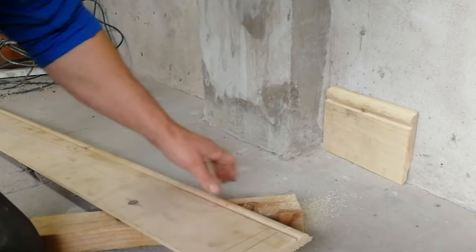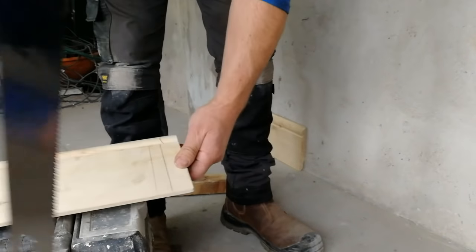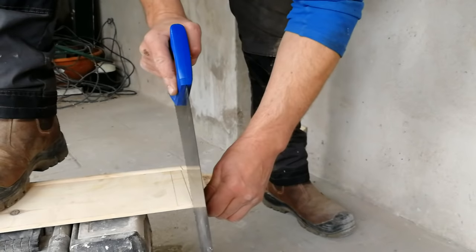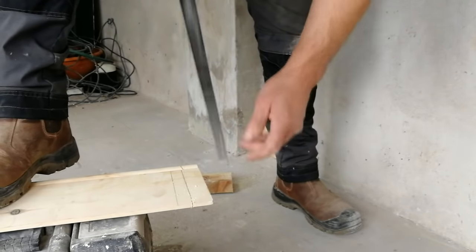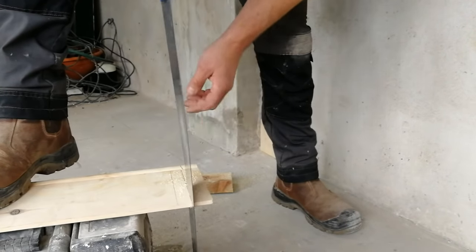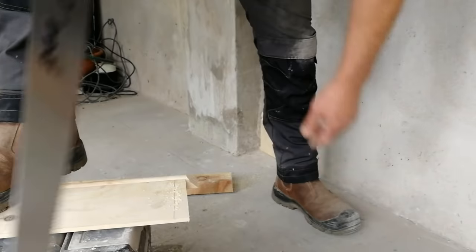So now what I'm going to do is cut this out with the saw and cut it all out again. I've put it on a little bench — there's the pencil line, I'm going to cut it out. Just cut it slightly back, like so — just adds a little bit more clearance at the back of the skirting, makes things a little bit easier if you need to take a little plane to it. So I'm just going to tilt it back a little bit. Nice short steps. Use the back of the saw — cut it with the back of the saw. Don't focus on the front, focus on the back. Lean into the back of it. Snap it off.